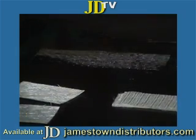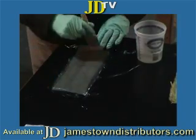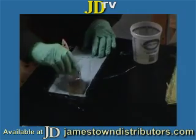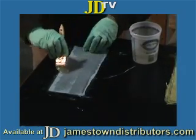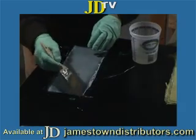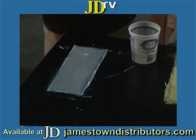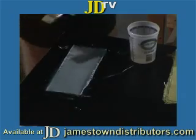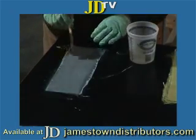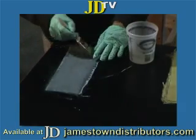When we're done with that last layer, we're just going to put a layer of the nylon peel ply — that's the blue material. That's just going to give us a nice smooth surface on the top. It's the nylon combined with a silicone additive or vinyl finish. When we're done, we'll be able to peel that off and it'll have a nice, slightly abraded smooth surface on the top. Whatever finish you have on the top of the peel ply, you will get transferred to the top of the layer, so it does benefit you to take some time to squeegee out those little wrinkles.